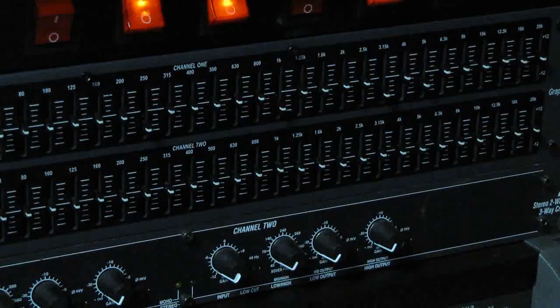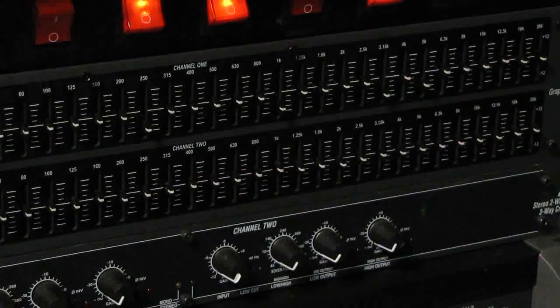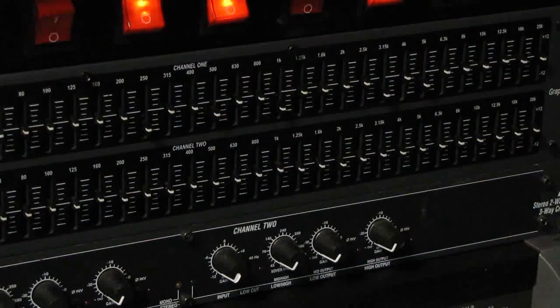We'll take out 1K. We're adding a little bit more gain and we're almost at full unity on the board. I would probably leave it at this point and not get much louder. Normally I would not have a setup with the mic sitting almost directly in front of the speaker. So what we've done on the Sennheiser is we've built a notch at 250 — not a very narrow notch but a wide one — and we've gone down at 1K and 3.15K. This is our reduction profile for a Sennheiser E835. We could probably clean it up a bit more, maybe get rid of some of that overtone at 500 Hz. But we're reducing a lot of frequencies, which draws away from what the performers hear on stage.